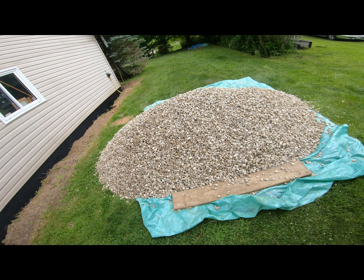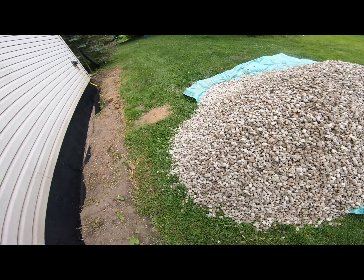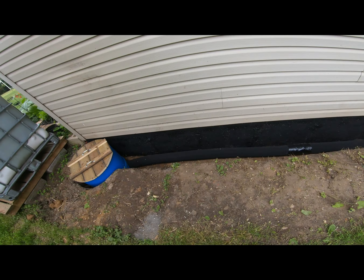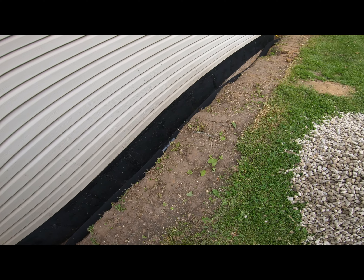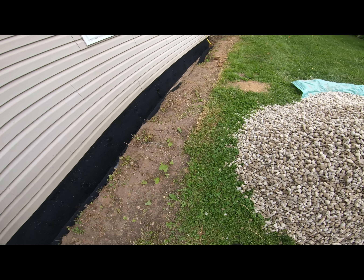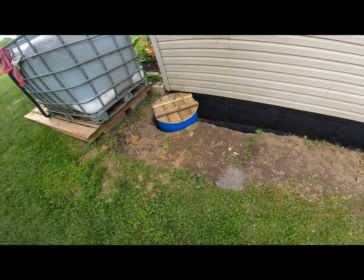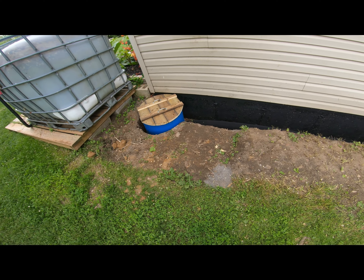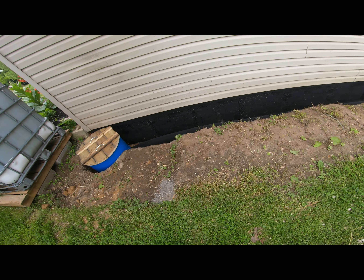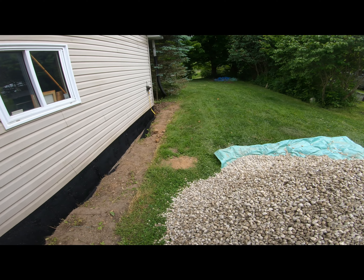I got a yard of three-quarter inch round clean gravel to cover up the sock, then top dress with a little bit of dirt to see how it goes. I also want to do a cinder block wall, fill some of the gravel inside of that, maybe parge it with mortar to make it look like a big border brick around the spot for the sump pump. Hopefully our water problems will be gone.